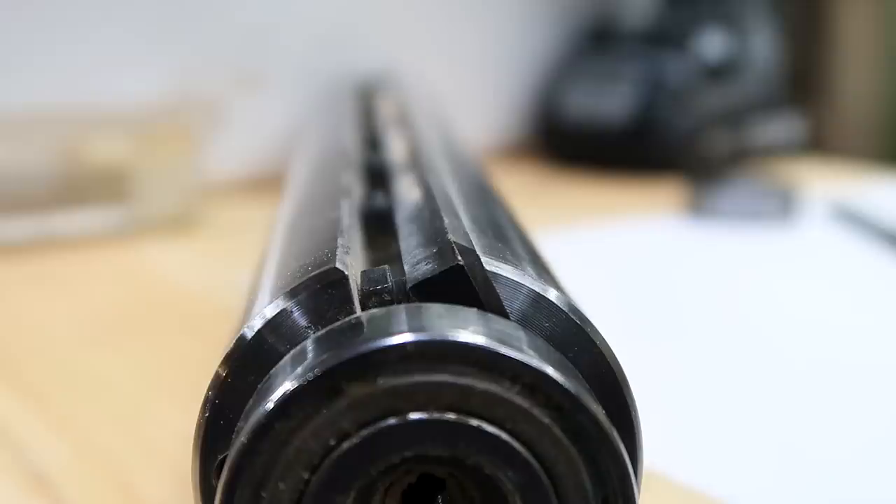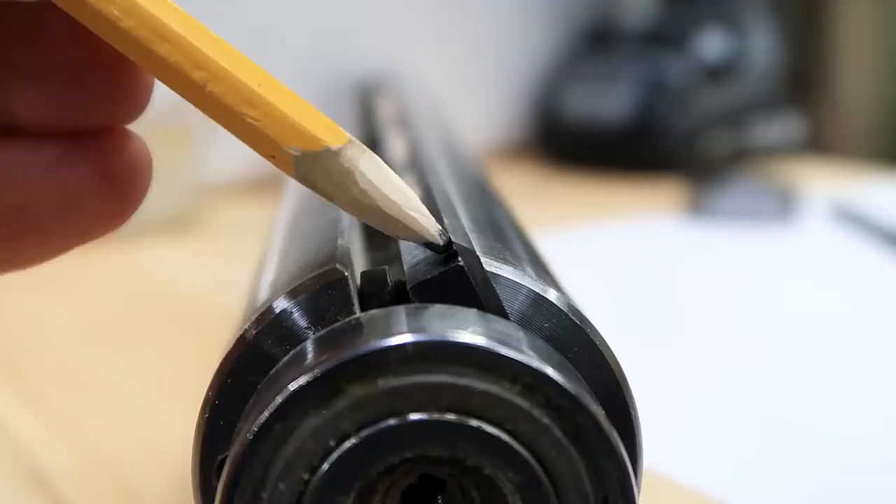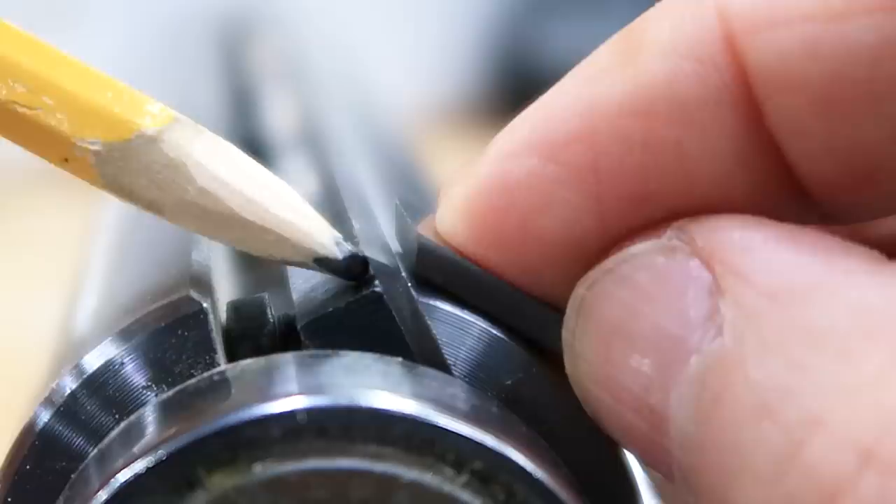That's really no surprise because this is a knife on my old planer head — imagine the carbide insert screwed on there. You can see how the knife is much more of a cutting edge, whereas the carbide insert's edge actually almost goes down to the center of the head. So the carbide insert is more of a scraper whereas the knife is more of a cutter.